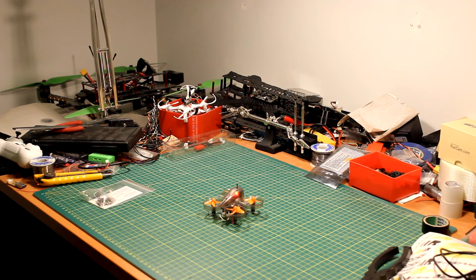That is a really simple mod for this quad. The other advantage is that brushed motors wear out, so the ability to get additional motors from another supplier is always handy. This is why I'm keeping the originals — eventually the motors in there will wear out and I can just swap back the old ones while I wait for more. I'm probably going to get some more props and just have fun with this quad. If you like this video, give it a thumbs up, maybe think about subscribing, and possibly leave some comments. Thanks very much.